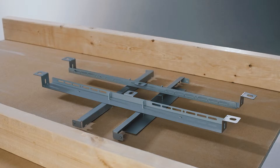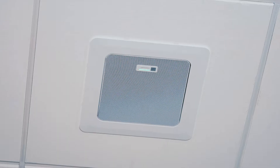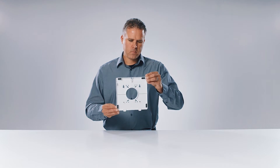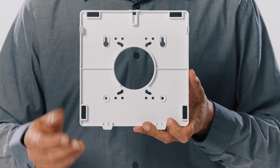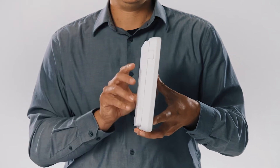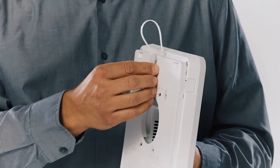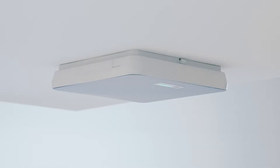The microphone includes features and accessories that enable it to be installed on a hard ceiling, open ceiling, or drop ceiling. The surface mount adapter is designed to mount the microphone on the surface of a hard or drop ceiling. Once mounted, the microphone can be lined up using the indicators on the mount and snapped into place. A zip tie is provided as a secondary means of caution to lock the microphone into the surface mount adapter, similar to an access point.